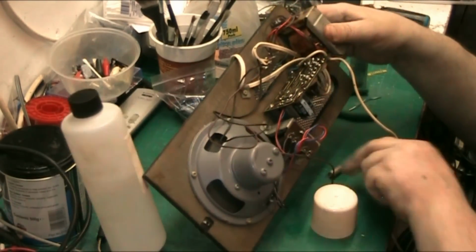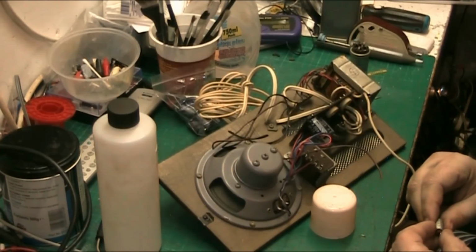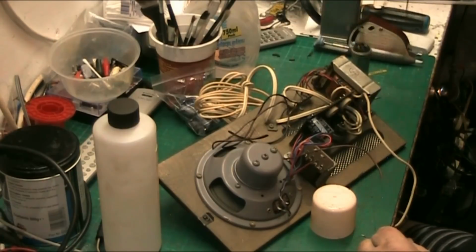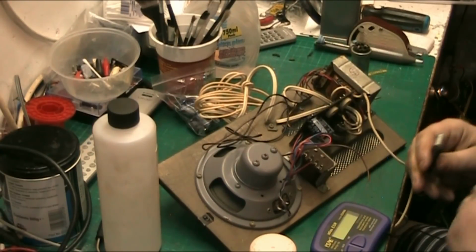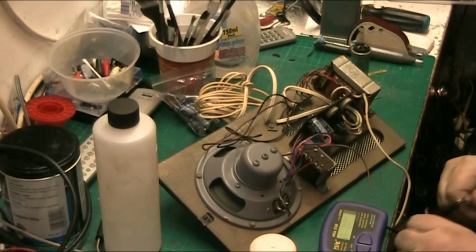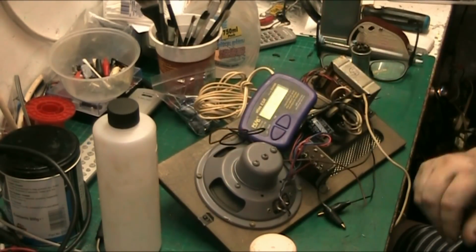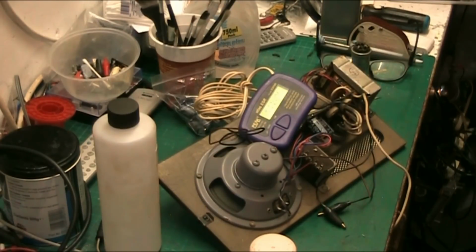So let's get the capacitor. Let's test that one. What voltage are we? 50 microfarads, 25 volts. So we can put a 47 in there. Not one of them big ones. But I'll get one out of stock in a minute. Yeah, 50 microfarad at 25 volts. You can put a 47 in. 42. Yeah, that's a bit down, but the ESR on that is 4 ohms. 4.1 ohms, so we don't want that. That's bad, really bad news. That's higher than a hippie on the third day of an open air festival. We don't want it that high. We want a 47 UF.